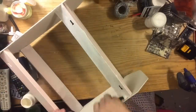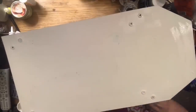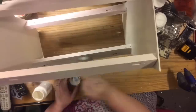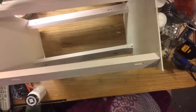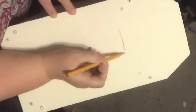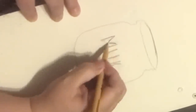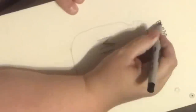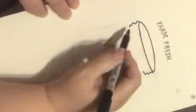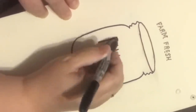I left one board to paint while assembled to show it's not impossible to paint them together. I went over all the screws to make them white, filled in whatever cracks with hot glue, used a gift card to level out the glue before it dried, then sanded it nice and even and painted to fill in all the grooves. The inspiration piece had pretty French milk farm decals, but I decided to hand paint. I made a mason jar that said 'milk,' drew it in pencil — pencil is very forgiving on chalk paint so you can erase as you go — then went over it with a Sharpie.